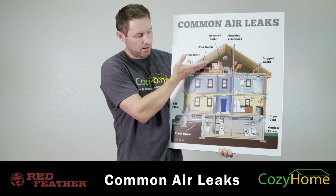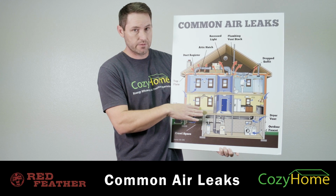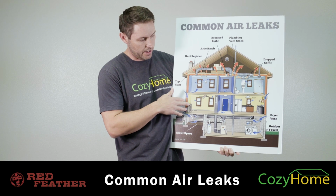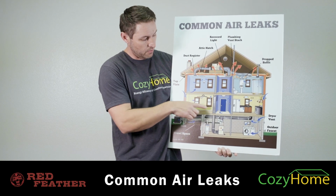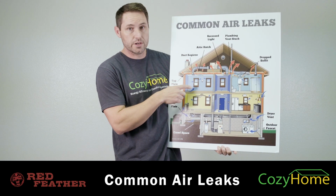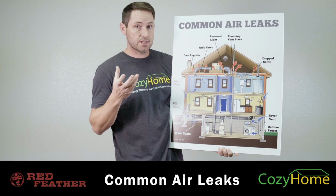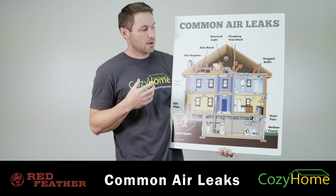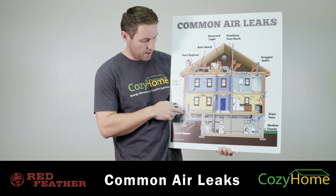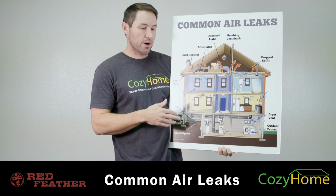And then anytime air is leaking out of your house, air has to leak in, and so cold air will come in towards the bottom of your home. That's where we're more familiar with a lot of the air leaks, the ones closer to the bottom. Some real common ones are around doors and windows, but some other places you might not think about are anywhere where there's a hole in the drywall. So where you have ductwork or heat registers in your ceiling, lighting fixtures in your ceiling. Wall outlets can be a big one, as well as spots underneath walls, where walls meet floors. That can be a spot where air can leak in.